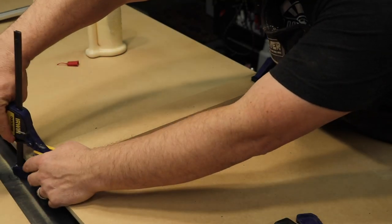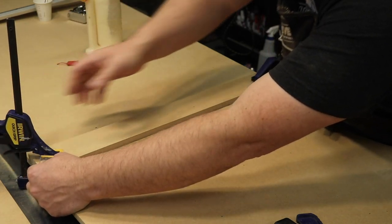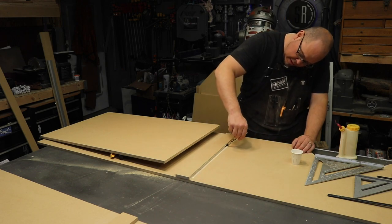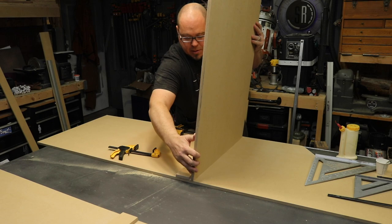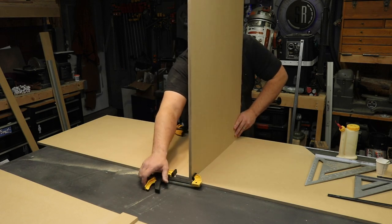Okay, you know that I think MDF is awesome for the lack of wood grain and the ability to create seamless details in a project like this. But the downside is durability. This piece I'm working on is to create the support for the main shelf in the center of the paint booth. If I'd used a material like 3/4 inch plywood, I could have ran a dado down the left and right panel and secured the shelf within the dado slots.